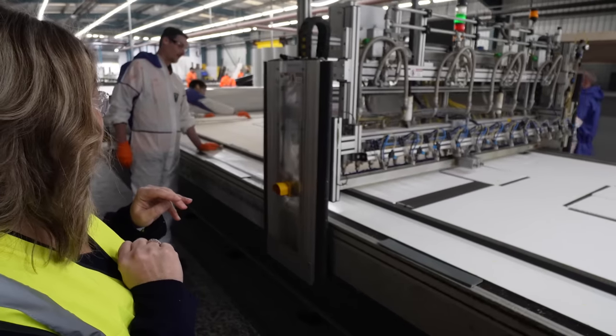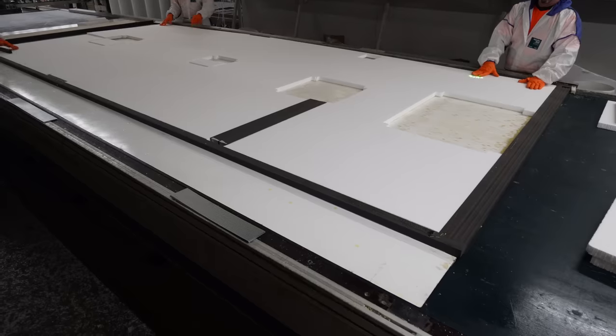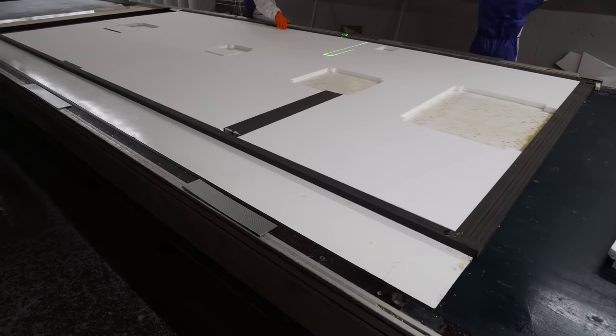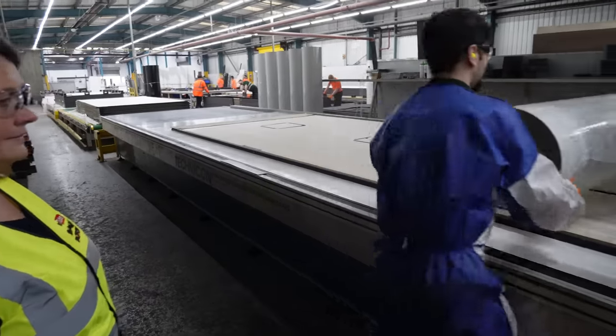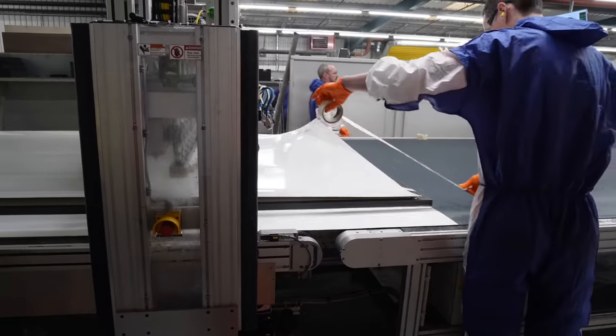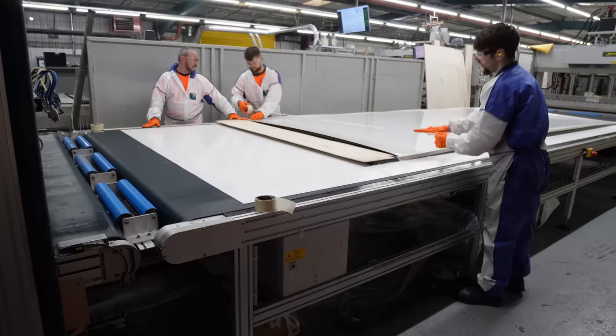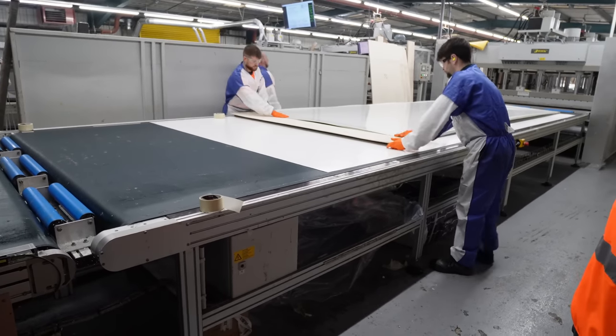Even the flat side panels of the motorhome are assembled away from here. First a frame is made out of polyurethane posts. The frame is then infilled with polystyrene. Flat precision pre-cut sheets of GRP are rolled and glued over the frame — the glue takes just six minutes to cure. The resulting side panels are lightweight, waterproof, super strong and durable.